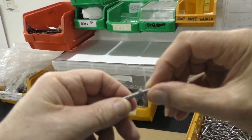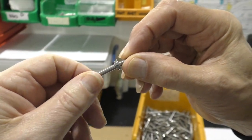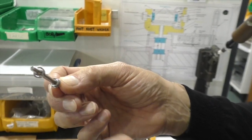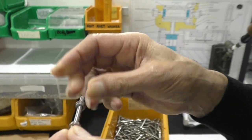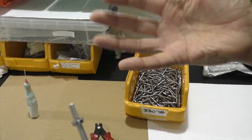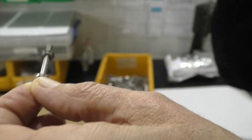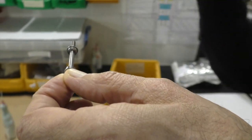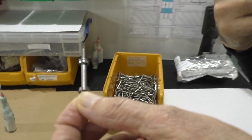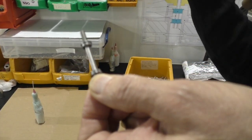Inside each of these, is there a ball race? They're normal precision ball races — tiny, small ones. They're high-quality stainless steel. They're what are called ABEC 7 bearings, which are the highest grade you can get. They're even noise tested — run up under a microphone and the microphone picks up the noise. Each one of these gets done by the supplier for us.